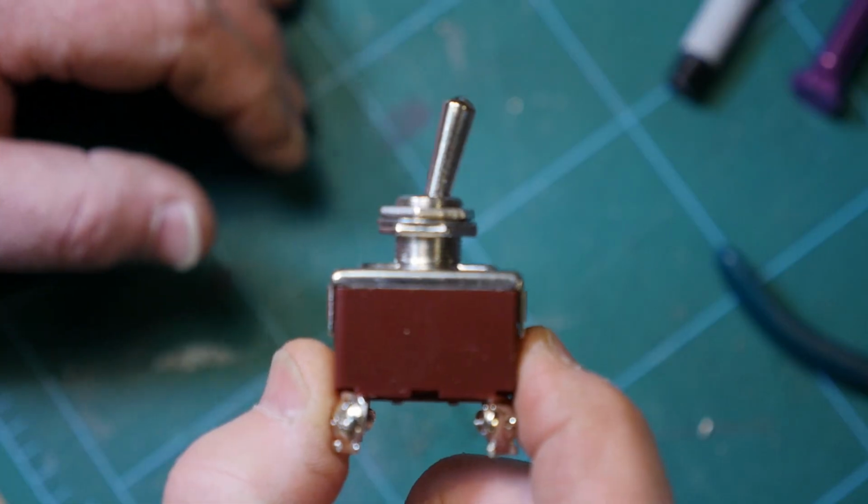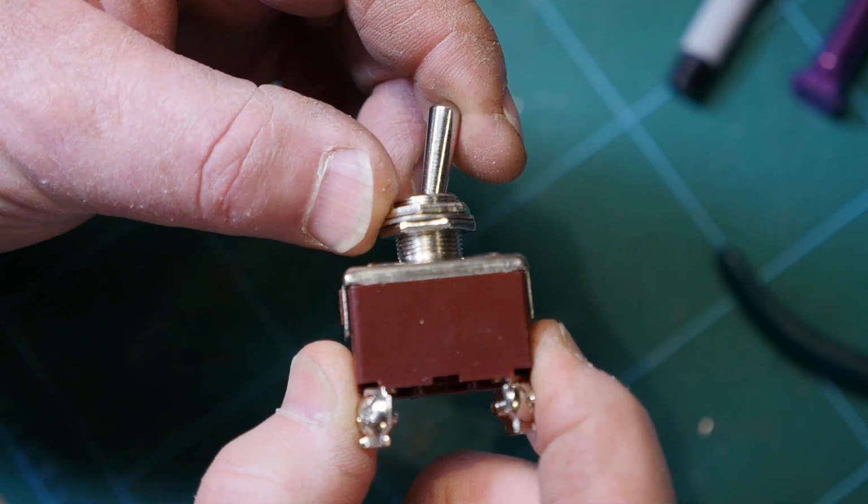With normal 120 volt wiring, you only need to put a switch in line with the black wire, or the hot leg of the circuit. Now with 240 volts, you need to switch both the black wire and the white wire, as they both carry electrical potential. You don't need to, but it's good, safe practice. All you need is a double pole, single throw switch.